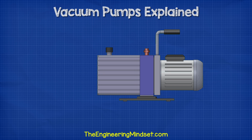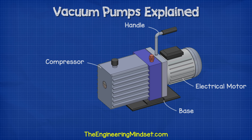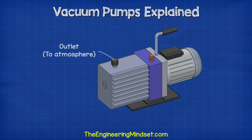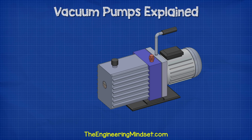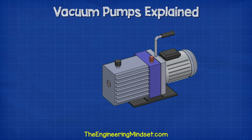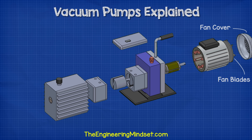If we take a standard vacuum pump which looks something like this, we have the electrical motor on the back and the compressor on the front. On the top we have a handle and on the bottom we have a support base. We then have an inlet which connects to the system to remove the air, and then above the compressor section we have the exhaust or the outlet. On the front of the compressor section we find an oil sight level glass so we can tell how much oil is in the chamber as well as its condition.